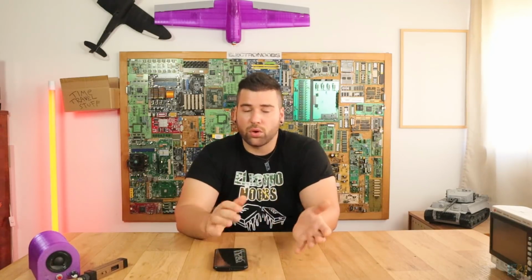So all you have to do is to detect the firing point of the AC voltage, and then the PWM signal from the PID controller project will apply on the amount of the delay of the firing time, in order to control the power that will go to the heating element in your case. So all you have to do is to combine those two codes together. So stay tuned, I will make a video about that in maybe 2 or 3 weeks, so stay tuned for that.